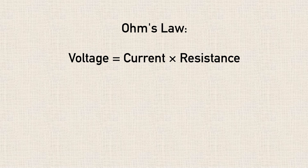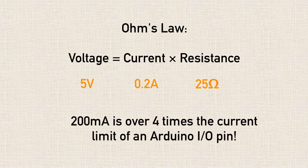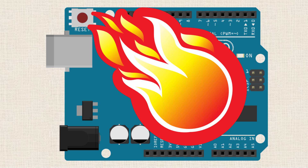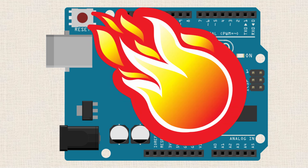Here's why. If we look at Ohm's law, we can calculate the current moving through the pin. When the voltage is set as high on an Arduino pin, it delivers 5 volts. The internal resistance of an Arduino I/O pin is about 25 ohms, so the current is around 0.2 amps or 200 milliamps — significantly over the 40 milliamp limit we just talked about. Without a current-limiting resistor between the I/O pin and ground, we exceed the maximum allowable current flow and the pin's fried. Setting pins as outputs and writing them high is something we do all the time, so this is probably the most common mistake. When you've got a ground rail and voltage rail on a breadboard and you're prototyping, definitely watch out for directly connecting an I/O pin to ground.